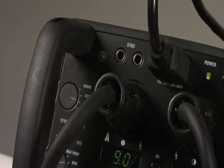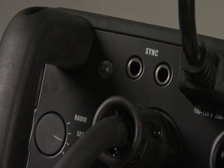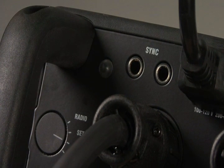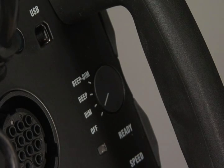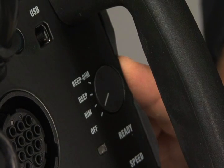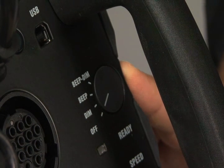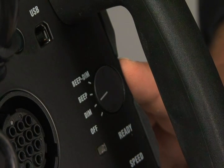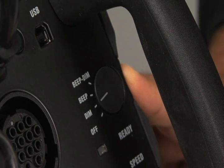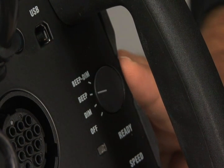Starting from the upper left-hand corner, we notice the white light slave standard on all Profoto generators. The dual sync socket for tripping the generator using a sync cord. Here's the on/off button to turn the pack on and off. The USB socket can control up to 127 generators hardwired to a computer using Profoto's studio software. The ready indicator gives you four choices to let you know when it's recycled. In the off position, the pack makes no beeping noise and the modeling light stays on while charging. In the dim position, the modeling light visually dims when the pack is recharging.